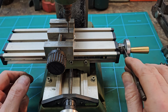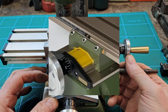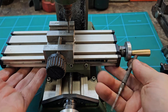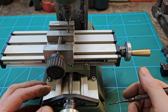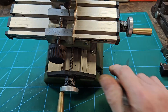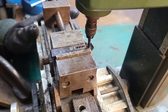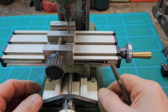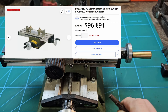Other issues: a piece of plastic chipped out of the way covers. The way covers that went there — one came out of its guide and wouldn't allow the table to move properly, so I took it all apart thinking I'd re-insert it, but it had warped, so I had to do a way cover delete. Another piece of plastic chipped out as well. On the plus side, the XY table is just bolted onto the base, so you can take it off and use it in other applications — Proxxon actually sell just the XY table for that purpose.